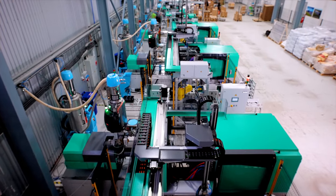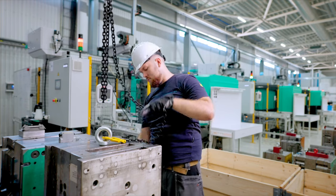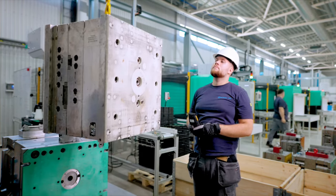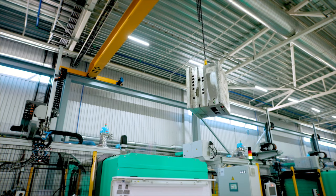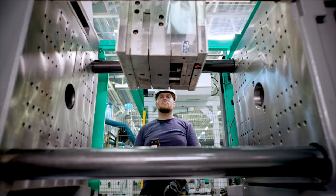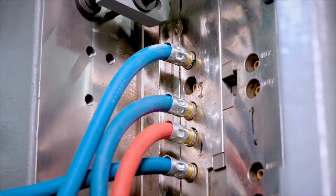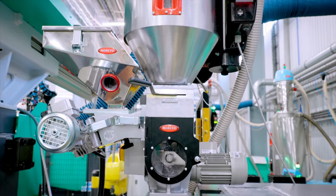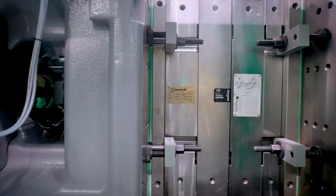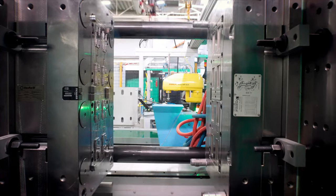Following our intensive testing and assembly, let's step back to another crucial manufacturing step: the integration of plastics. First, each individual mold tool, designed specifically for a unique product shape, is precisely fitted into the plastics molding machine. The plastic is injected into the mold, and once cooled, a robotic hand retrieves the solidified parts.